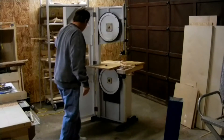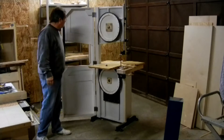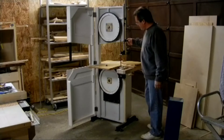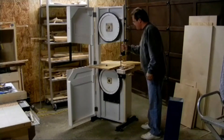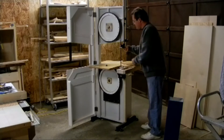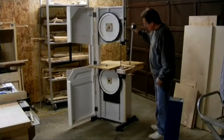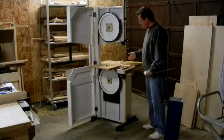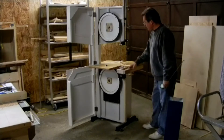The cover opens in one piece, completely. It's hinged on the frame with three hinges. The upper blade guide is easy to adjust with this thumb screw right here — you loosen that up and then you can lower it down or raise it up. It goes up as high as 12 inches of re-saw capacity exactly, between the table and the bottom of the blade guide. I don't anticipate having to cut something 12 inches thick, but you never know.